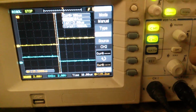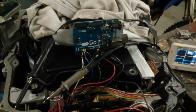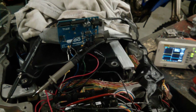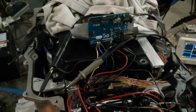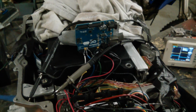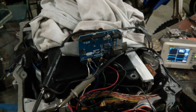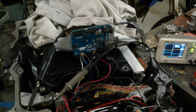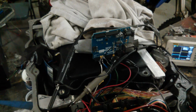Always. So basically, what I was trying to explain before was I had events where the low side was turning off and then the high side was turning on. The high side was the one that was trying to produce the current. The low side was not actually trying to produce current. And when the high side turned on, it caused the ring. And that's how I diagnosed my problem, seeing that it was switching too fast. Because the low side, when it was turning on under load, would ring such a small amount that it was really hard to see. And the desaturation detection would kick in because the emitter, which is DC negative, would bounce up and then down. And when it bounced down really fast, that would kick the desaturation detection and trigger it and shut everything down. So anyways, you can see it right there.